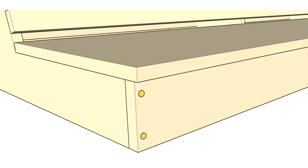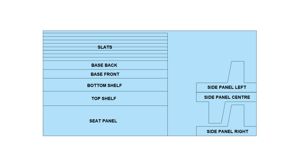They wanted the wood to be as light in colour as possible, so we settled on birch ply for materials, and the design for the interior of the rest of the shop was going to include some metallics, so I suggested using brass dowels as an accent for the joinery. I also made a drawing of the cuts I'd need to make to figure out how much plywood I would need, and I figured out I'd need 2 sheets.